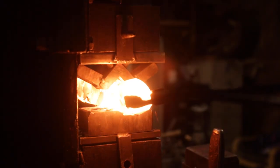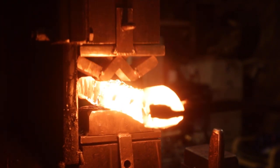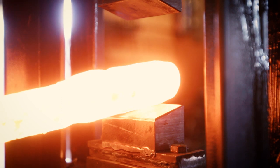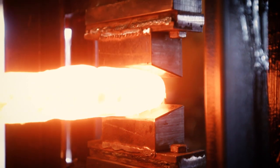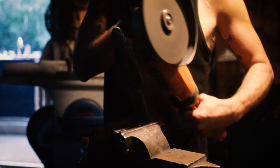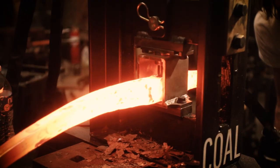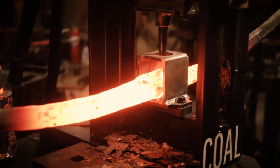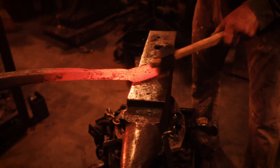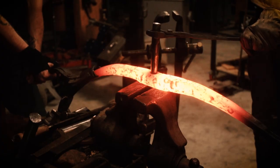Now onto the arms. The challenge for this piece is always symmetry with multiple tapers and different orientations. We started out with a square die-flat die combination to help establish where the flukes were going to start, as well as keep the center line down our material. Again, back to the butcher dies to make quick work of the spade-shaped flukes. After a little bit of cleanup, it was time for one of the most stressful parts of the project — punching a hole through the center of all this material. I should have guessed that the punch and stripper set would make that an absolute piece of cake, in one heat, no less. From there, we spent a little bit of time doing cleanup on the facets and the arms and shaping the flukes a little bit more. We drifted and checked the fit over our tenon.